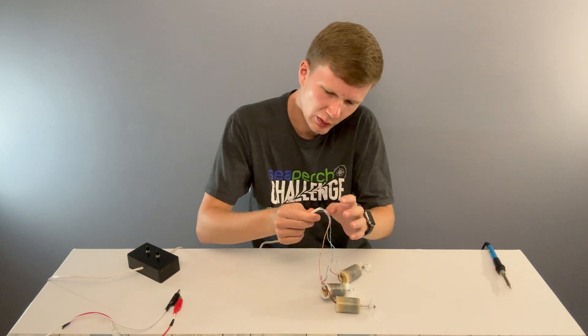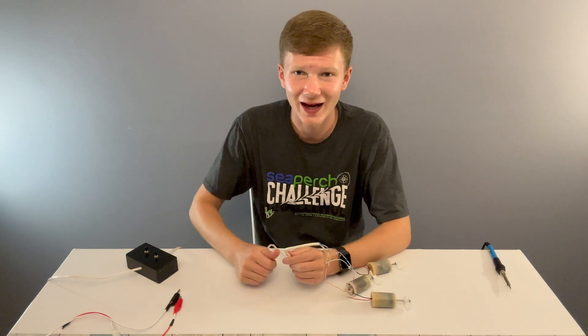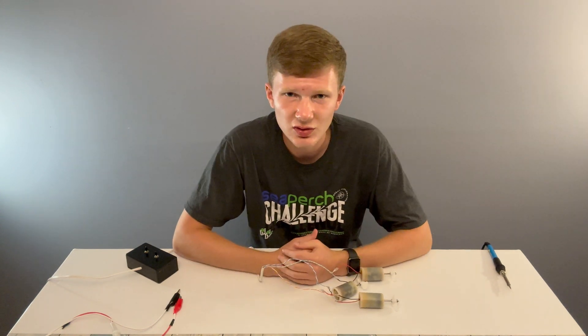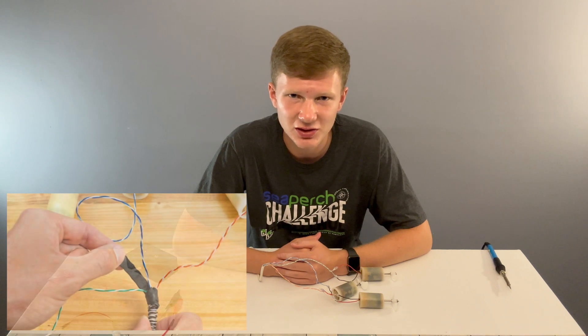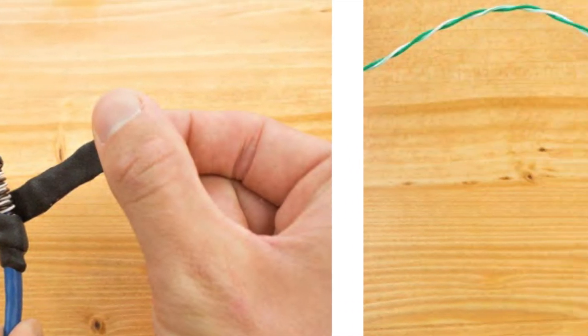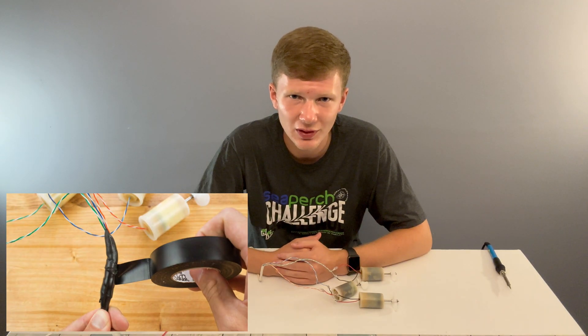Now let's waterproof this end of the cable where the insulation ends. You don't want water getting up through this cord and into your controller through capillary action. Get liquid electrical tape, hot glue, or the polybutyl tape and seal off the end the best you can. To use the polybutyl tape from the Sea Perch build box: cut it into three equal sized pieces, peel off the backing and stretch it two to three times its original length — stretch it out evenly. Weave it around each of the colored wire pairs where they leave the insulation. Knead and work it so it forms a nice seal. Do the same with the second piece and wrap the third around the whole thing. Then wrap all of the polybutyl tape with electrical tape.